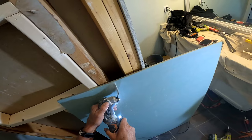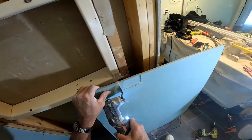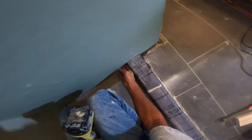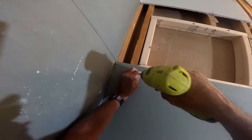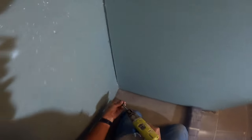As all tilers who do bathroom and shower renovations know, almost all failures — I'm going to say 98% — happen at the curb, left and right of the curb, where those vertical studs get rotted out and the curb itself sometimes gets rotted out. By raising your backer board off of the floor by one inch on all four sides, you stop the issue of wicking. Never have your backer board inside of the pan, and also raise your wall board.